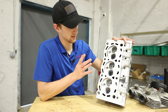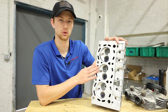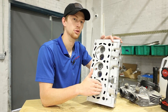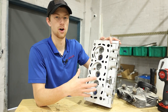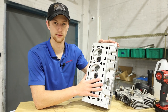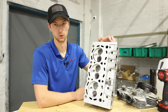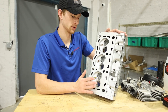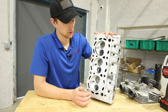A few of the other benefits of vapor honing and reasons why we actually use it in our shop: when you are blasting with an abrasive on soft aluminum, you do not have to worry about media embedment. That glass bead can get stuck in cavities — that's why you have to clean the part afterwards — but it's not going to actually embed itself into the part, which could otherwise bake out later when you put this thing back in service. Once you run water through this and remove all that abrasive, you are perfectly fine to put it back into use. And another thing: with not actually embedding media, you do not destroy any of your tolerances with vapor honing. Even if you hold the blasting gun in one area too long, you don't have to worry about treating this thing incorrectly. Of course you'd want to re-lap your seats, and if you're doing something like a cylinder you'd want to re-hone the cylinder, but as far as actual tolerances, vapor honing does not degrade those. It is an amazing process when it comes to anything mechanical, such as dealing with an engine head just like this.